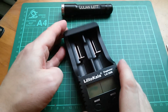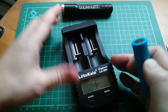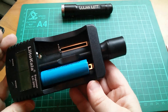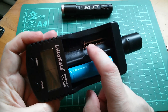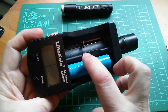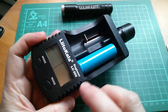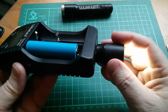Let's put a cell in here and first check out this USB power bank functionality. I've got an 18650 cell — positive is to the front. Now nothing comes up on the display, but the USB output now activates, and if I plug in this little torch head you can see that this operates as a standalone power bank. The power bank functionality works with one or two lithium-ion cells. It doesn't work with nickel metal hydrides, which makes sense because there really wouldn't be enough energy in a couple of nickel metal hydrides to run 5 volts for very long. In this power bank mode, nothing comes up on the display — it just turns the 3.7 volts on the cell into 5 volts and puts it out on the USB socket.